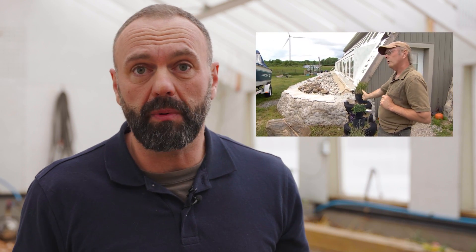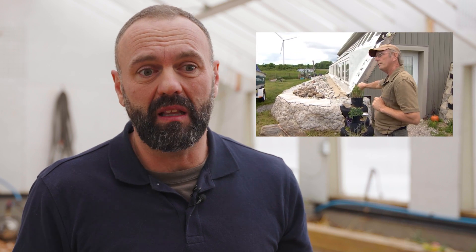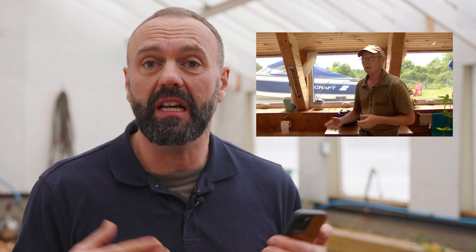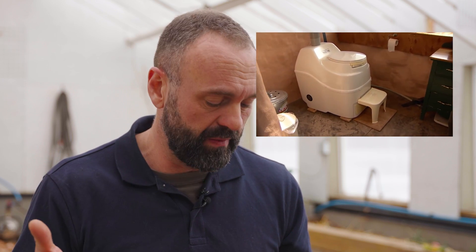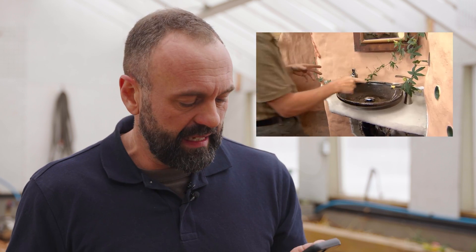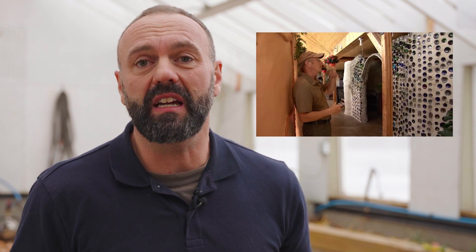One thing you have to be really cautious about when you build into the side of the earth is radon. Radon is a naturally occurring radioactive material that emerges from subsoils, and because earthships are built with subsoils all around them, you can end up filling your house with radon. It's odorless and colorless, and it's actually the leading cause of lung cancer in North America, second to smoking. Make sure you test your soils before you build one of these. Overall, the design of this particular earthship is fairly simple, and I do really like small, simple, multifunctional designs. I'm sure it's an absolute joy to live in, other than some of the constraints I mentioned.